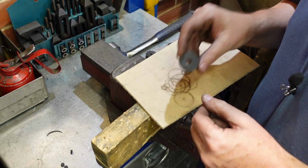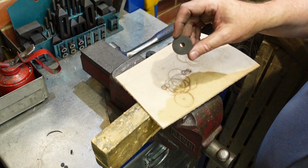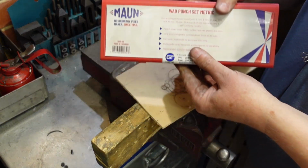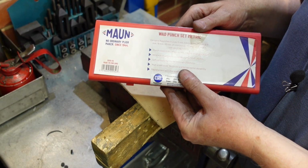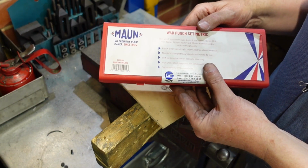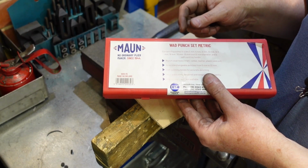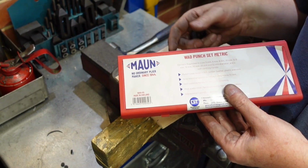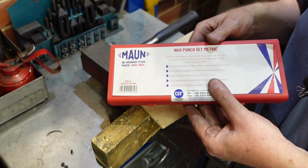So if you ever have to do that sort of thing, a wad punch, as I said, the brand is Morn. They're a UK brand. If you're in Adelaide, I got mine from General Tools, but other people will have them. Not sponsored or anything like that, but worth getting hold of if you have to do lots of these sort of rubber or soft material washers that you can punch out.